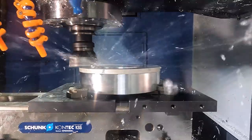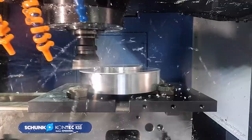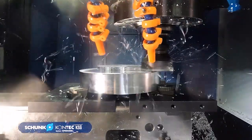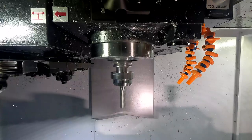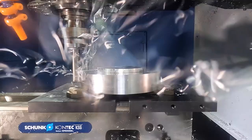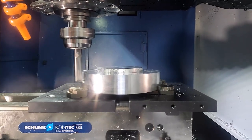I start looking at it and I asked: did you indicate your drills in? He said no, we never do that. I said what are you talking about — every time you take one out and put a new one in, you've got to indicate it in. They had them in ER32 collet holders.